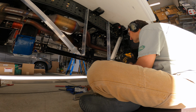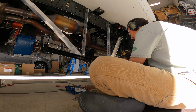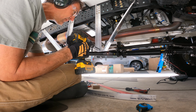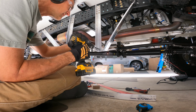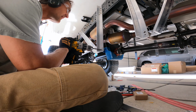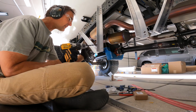Each one of those has 3 or 4 bolt connections to the chassis frame, so they are on there very strong. And so I angled these angled ones in a way that they could actually attach to the frame rail with at least a couple different attachment points, and then of course bolted all the way through in the bottom with another set of angles wrapping around, call it the frame of the skid plate, and then the skid plate itself actually bracing up against that.